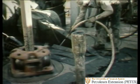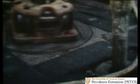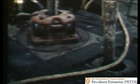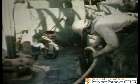One of the most common maintenance problems, and one which can lead to serious repairs, is caused by the rotary drive chain guard filling up with contaminated lubricant. In other words, if you're not careful, mud will seep into the oil which is lubricating the pinion shaft. This occurs when the mud, which falls down into this gap, is allowed to remain there. So wash it out as best you can.